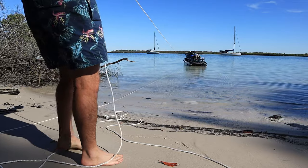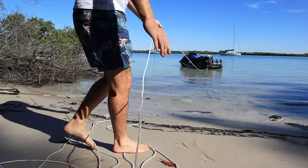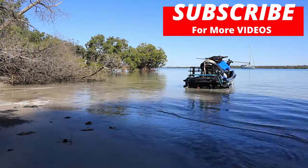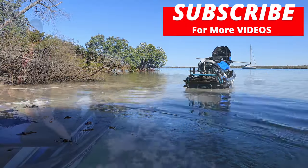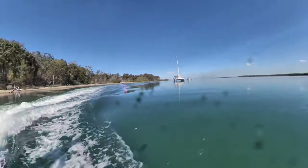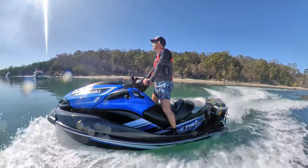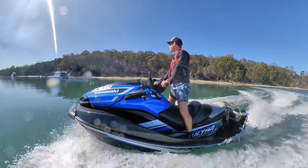When it's finally time to leave and go home, simply pull your vessel into shore, remove the bow and stern snap hooks, and pull all the loop rope into shore. You can then safely motor out to the anchor rope float and pull it up to retrieve your anchor. I hope this helps — let me know in the comments if you have any other anchoring tips or tricks, and please click subscribe. It's totally free and helps grow the channel. Thanks for joining me today.